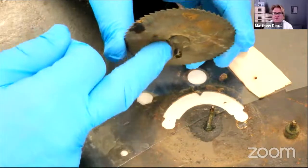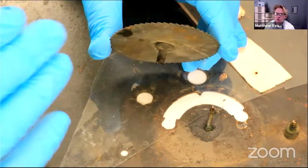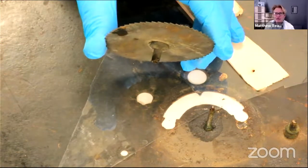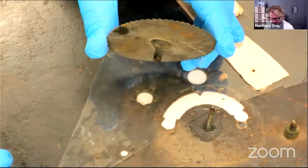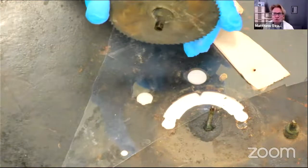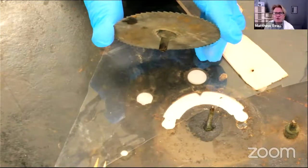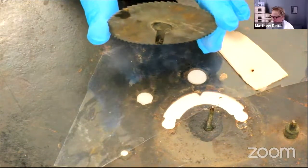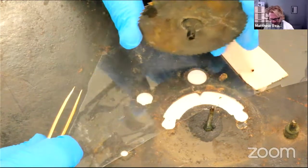The disc is hardened. You see this on those bigger date discs and moon discs where they get a lot of stress, corrosion, cracking. Do not clean them in ammonia. Don't clean clocks in ammonia, full stop. But if you do clean the movements, definitely don't clean anything that's thin and highly stressed like this, because it will crack and it'll destroy it. Hence the season cracking. If you haven't heard of season cracking, then Google it. It's a phenomenon where shells, apparently, maybe a made-up story, cracked due to ammonia from horse manure in the Boer War, was it? Season cracking and moisture. Anyway, that's what happens when you put ammonia near stressed brass like this.